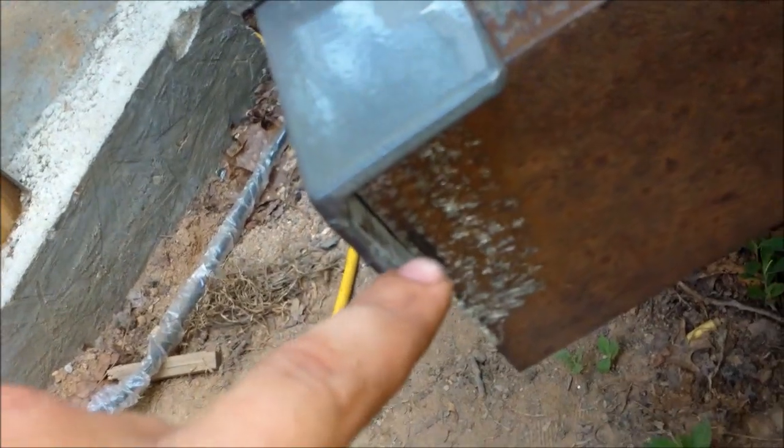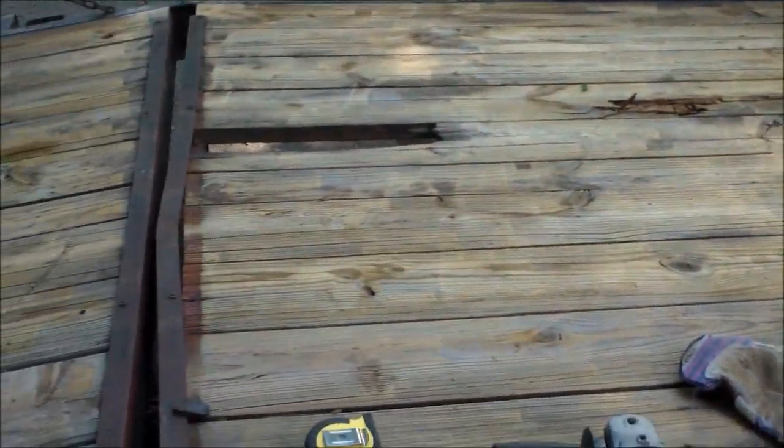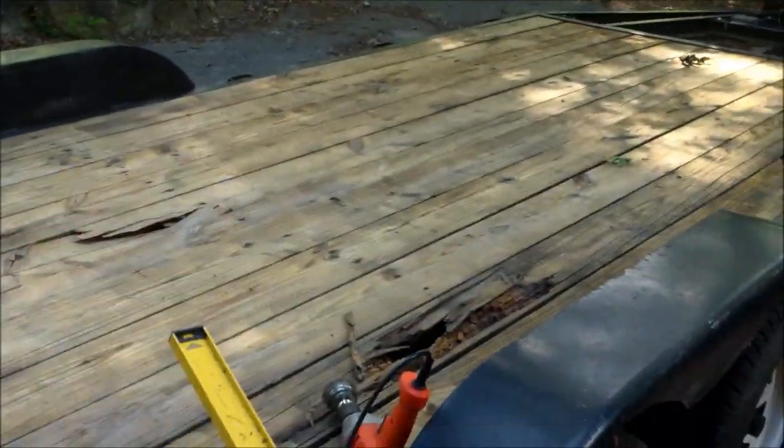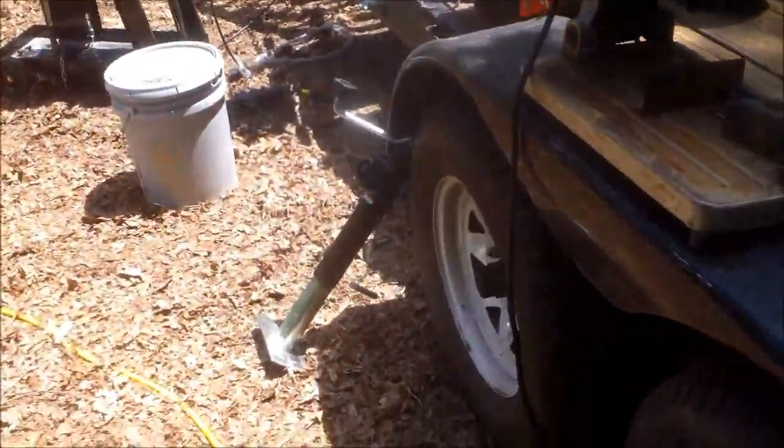The places I'm going to weld have been ground down. I'll weld carefully and do a little bit of underside welding to add strength, and then it'll basically be installed. I did add a slight lean to the left because my trailer isn't loaded. When it is loaded, most of the weight is tongue weight since the tires are so far back, so I figured that would level it out once I get a couple logs in it.